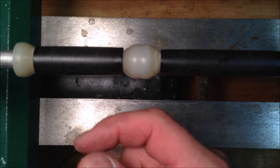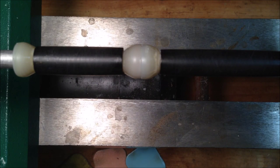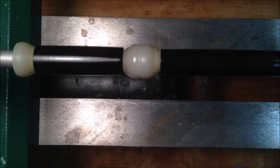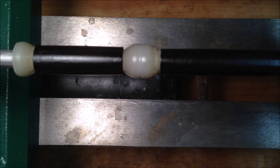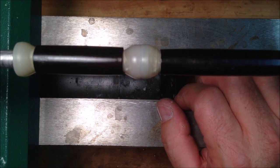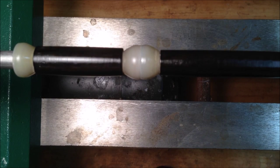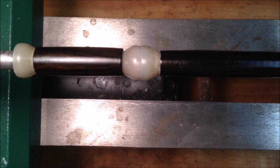Wow, this pen is really turning out beautiful — can't wait to see what it looks like when it's polished. I'm going to go ahead and get my CA glue and put three more coats on. This blank is looking really good — the voids are almost level with the surface. As I look at it at an angle I'm not seeing any ridges; the CA glue has really put a smooth finish on it. I think I'm going to apply two to three more coats just to finish off that last little void area. I lost track of how many coats I applied — it was quite a few, maybe 15. Now I'm going to use a little bit of my one-step and polish this blank and see how I can make it shine.